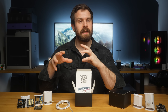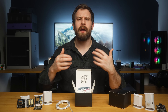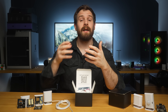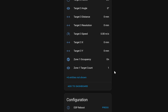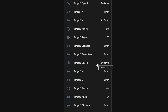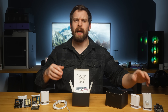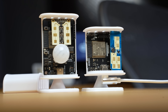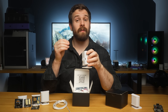The X coordinate is how far left or right you are of the sensor, and Y is how close or far you are along that axis. Using these coordinates is how you define zones, which you'll also find in the entity section where you can define the start and end X and Y coordinates. It's a little tricky to set up zones in Home Assistant since it doesn't have a great way of visualizing them yet. I'd typically suggest standing in the four corners of the zone you want to map, taking note of the coordinates, and adding those into the zone information. You'll end up with binary sensors for each zone that simply indicate if someone is in that zone or not.